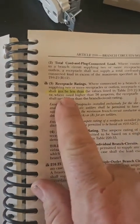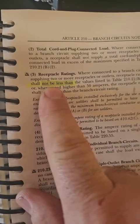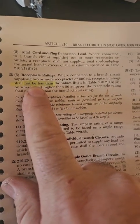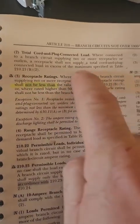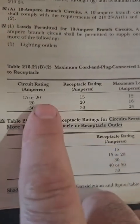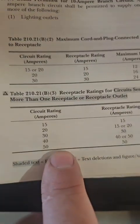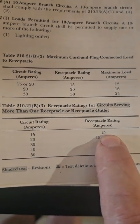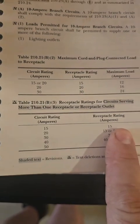That was voted on and approved as a code change for 2023. The way they did it is they removed the term 'shall conform to the table' to 'shall not be less than the table' — meaning it can be more than the table. The article here says 'shall not be less than,' and then you go down to the 15-amp circuits row: 'shall not be less than 15.' It says it in the text, but not in the table — and that's going to be important in a minute.